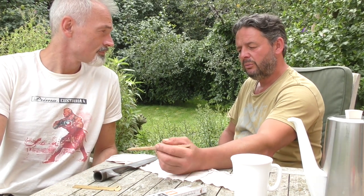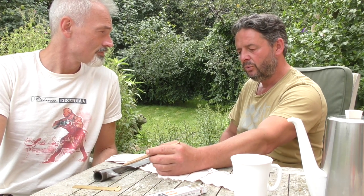And you can really define how much space you want here. It doesn't move much. Originally it was like 1.3 centimeters or so overlapping here. You have to play a little bit. These corners need to be pre-shaped a bit so they go nicely in. But it's details. This weld is really easy, and I use it for old spears, also for Iron Age spears, where they didn't use it, because I just improved the technique. It's a lot easier than the other technique, possibly also because I'm used to it.